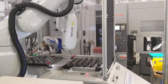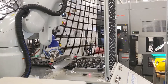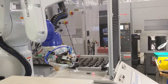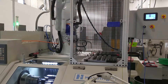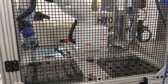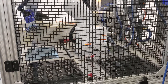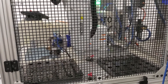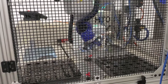This application has been a bit of a challenge, actually. Firstly, because the enclosure is a bit small, so I have to make some careful movements to make sure no part of the robot clips the enclosure. You might notice I'm using gated movements so I can go to and from certain places on the machine with less risk of hitting something. There's only one way to go from the enclosure to above the machine door, and that's very intentional so I don't have to test every possible movement between those two locations.